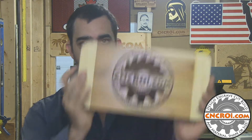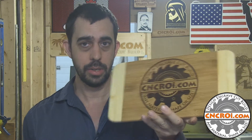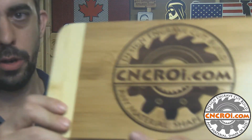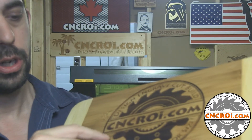And now you know how this here was produced. Application wise, there's a lot of applications where you want something darker. Generally signage made out of wood, you want something darker. Now the darkness isn't always the same — if we're doing something in a very light material like basswood, the darkness will not be as dark because the wood density is not as high. The nice thing about bamboo is that it's an incredibly dense wood, so you get a really nice result on it, even on very sharp details.